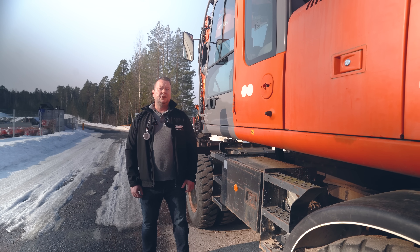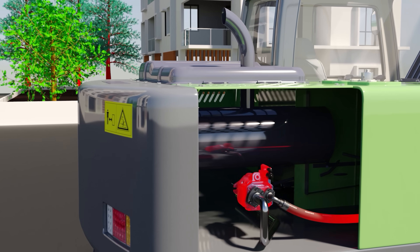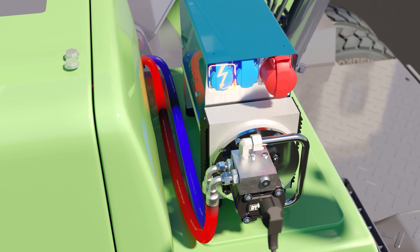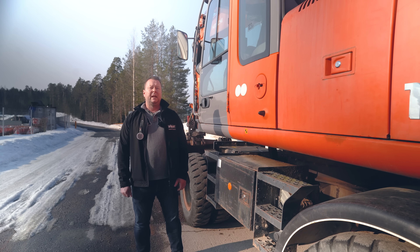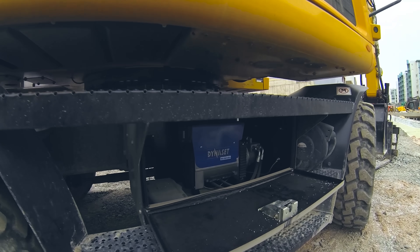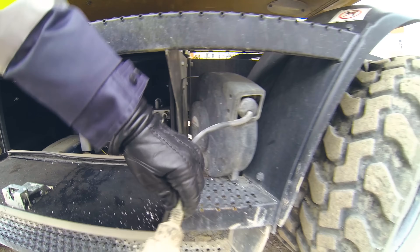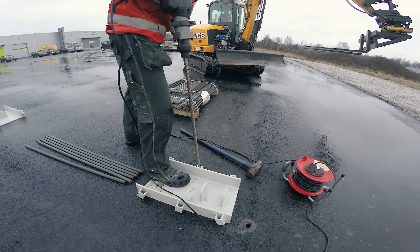Let's talk a little about the AC generators. The generator itself actually connects to the main hydraulic system of the excavator and it has a gear motor with a flow control block on top of it so that the frequency of the electricity will remain stable throughout the use. It can be installed in a toolbox like this, or basically anywhere on the excavator, and it provides you electricity for lights, tools, whatever you have needs for on the job site.